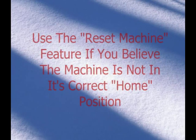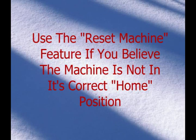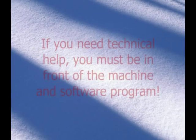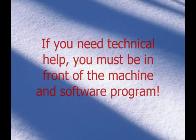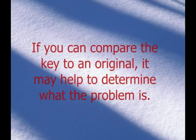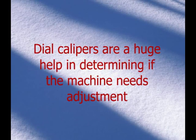If you have reason to believe that the machine is not in its correct home position, use the reset machine procedure described above to reset the machine. Be sure to have the spindle switch off for the operation. The machine is fuse protected. If you ever have a problem with communications, you may want to check the fuse in the back of the machine and make sure it is in good shape. If you are having problems cutting a key and need to contact us, we cannot offer any help without the following: make, model, and year of the car you are cutting the key for; code number you are cutting; and key blank number you are using. If there is an original key available, it would be helpful to have it and compare it to the key the machine is generating. Also, if you have access to dial calipers or a micrometer, depth settings on the key can be checked. In normal use, the machine will rarely, if ever, need adjustment.